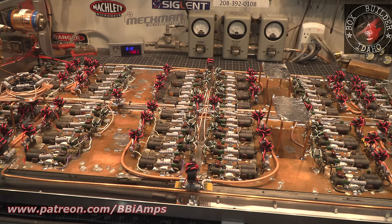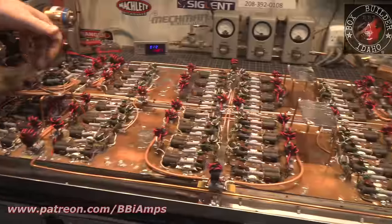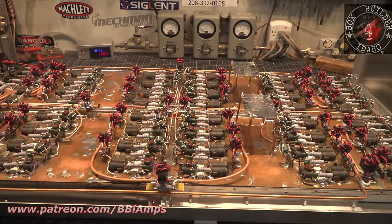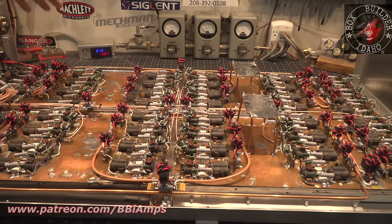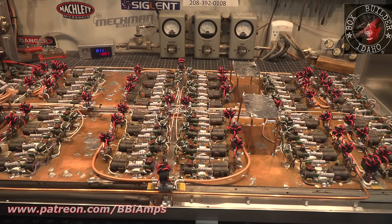So I had a choice. I could chase the 5-to-1 combination network, and I struggled with this for like a day. I sat down and thought about this for like a day, and there's some pros and some cons to this entire situation, right? The con is over here at the output network. What I came up with was, let's dump out the combining of this and this, this and this, this and this, and let's just go to a six-stage port. Because the only thing that's saving me is one layer of splitting and combining, and it's just one more layer of things to go wrong.